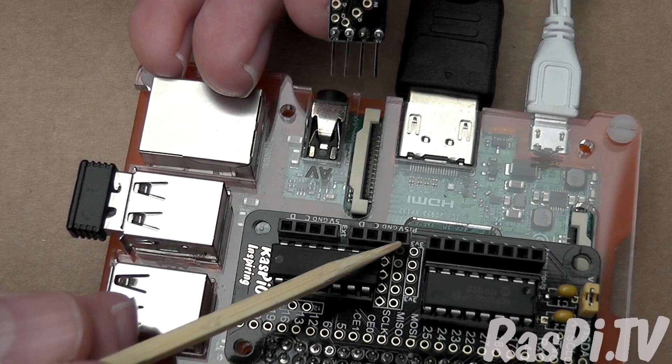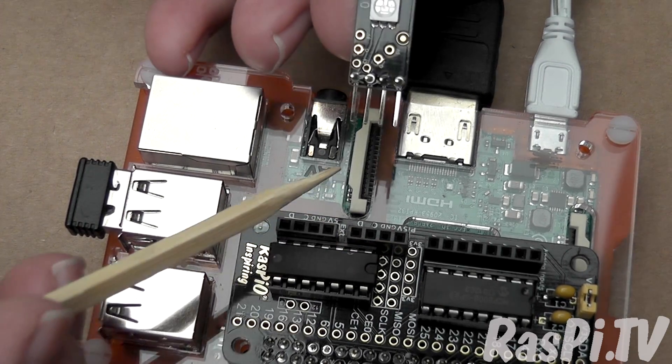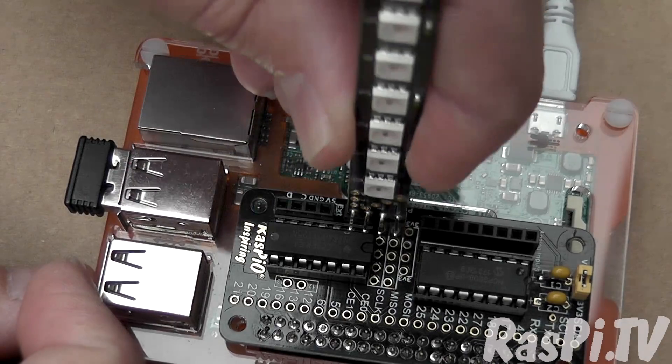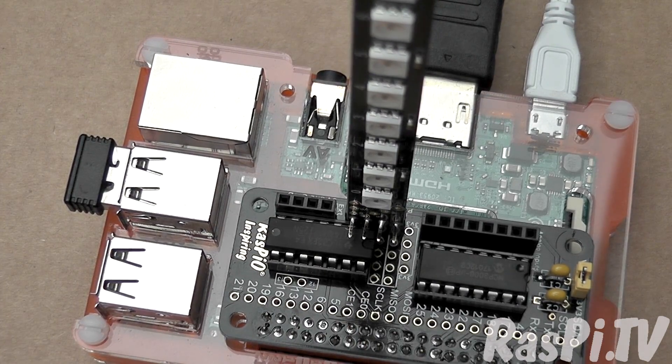So that wasn't hard, was it? Now our board is ready to test and ready to use. On the driver board you've got 5V, ground, clock and data, and on the Inspiring Strip you've got 5V, ground, clock and data — so that fits neatly into there. The strip we just soldered up is now working perfectly on the Pi with the driver board. It's a fairly straightforward process. You just have to remember: if you want to do it exactly the way I do, move the plastic on the male header and bend the pins on the female. But there are lots of different ways you could do it. The whole idea of Inspiring is that it's a flexible system. Have fun with yours. This was Alex Eames from Raspi.TV — thank you for watching, don't forget to like, share and subscribe.